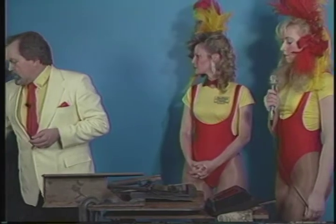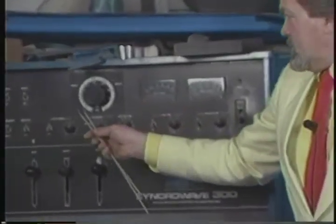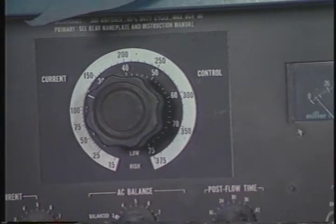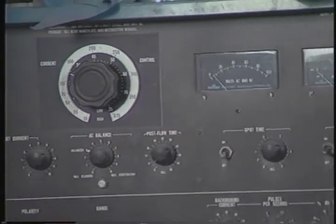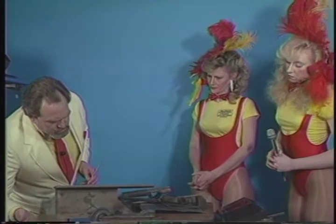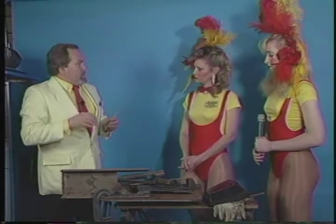For beginners, and by the way, one other thing. I do have a heat control here on this particular welder, and Chuck, can you pan over to the welder where I'm pointing? I had it set, and it's probably not exactly correct for this, because again, I don't use this very much as a stick welder, obviously, when I've got a heliarc machine. But I had it set at about 125, 130 amps. That's about half of what I mentioned before a person would need, about a 230 amp welder. If I were going to a heavier rod, heavier electrodes, I would probably crank it up to maybe 200, 225, something like that, which would be the limit of those little inexpensive boxes. But this is a pretty good thickness of steel, and I was able to put a decent weld down into it without a great deal of either undercutting or buildup on top. So a little buzz box can do a very nice job.